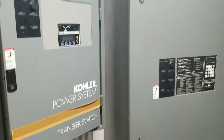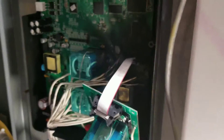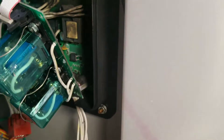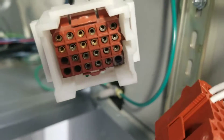Another night in our electrical room. Got these two guys doing complete controller replacements in both. Another guy installed this one and it's not his fault for what happened — look at that carnage. He blew a little resistor out there. What happened was he got sent with the wrong part; even our parts guy didn't know he got sent out the wrong part, and this happened. The A-phase went boom.